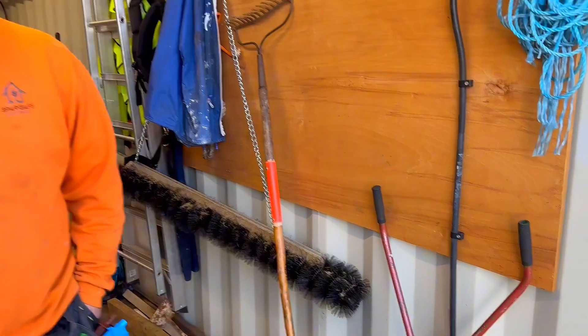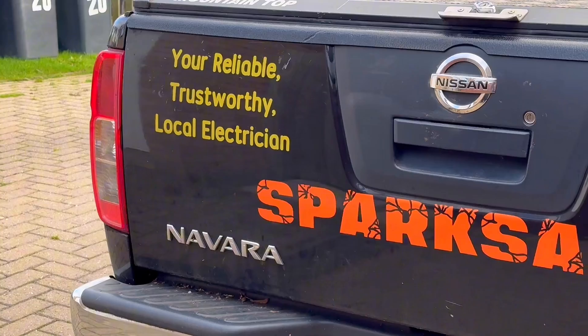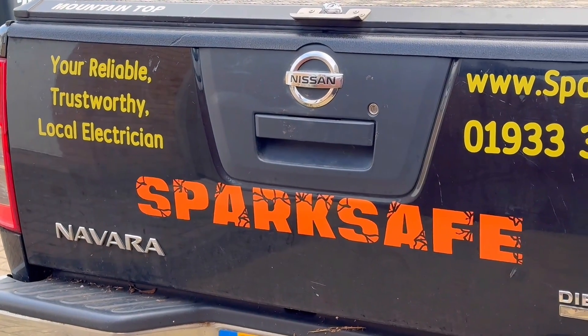I did inevitably code it to C3, but part of me wanted to make sure I didn't undercode it, so I actually spoke to my CPS team — that's what they're there for. Doesn't matter whether you know everything or don't know a lot, sometimes it's great to call on these people and get their advice. The bloke on the phone was in agreement with me — we wouldn't like to see it not on a TT system, however as part of the EICR it is only an improvement recommended, because of all the test results and the necessary RCD protection. So for me this is going down as a C3.